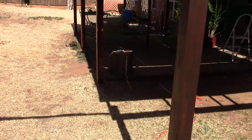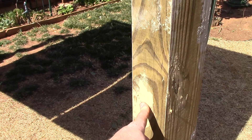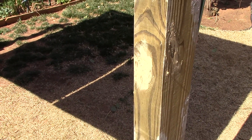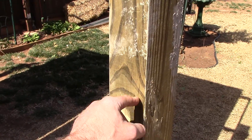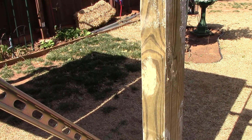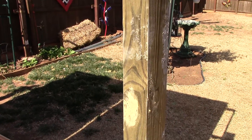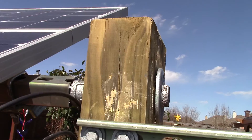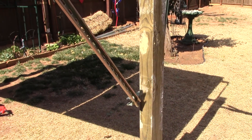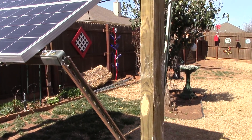Here's something I learned from working on this array. You see these marks? This is called Plastic Wood — I got it at Lowe's. Whenever this pressure treated stuff starts to settle and weather, it'll crack — that's normal and okay. What I find is that Plastic Wood is the best wood filler made; it really sticks and gets in there and stays. I'll just start filling in the cracks as I go, but I'm not going to sand and stain it for another couple more months — I want to get it through rainy season and tornado season before I make it all pretty.